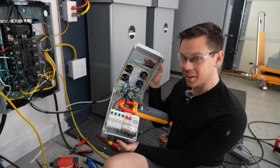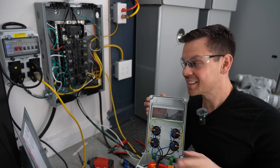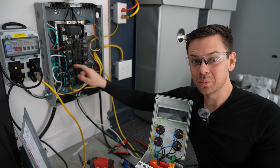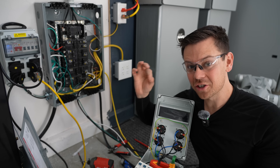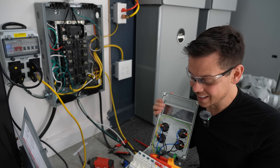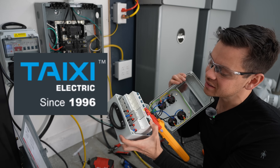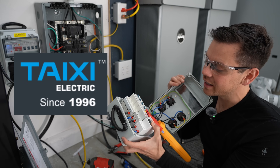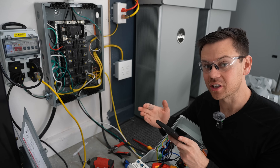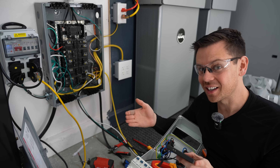These wires did pretty good — I was actually pretty impressed. I thought they would get much hotter. Now after that test, I'm removing this thing from my wall. It's not safe at all. This box is connected with an 80-amp breaker and a large conductor — having it connected to breakers that work like that is a bad idea. Just so everyone knows, the name of these breakers is TAIXI Electric. Let's see if these are UL listed. You won't believe how much garbage is UL listed — a lot of people think that if it's UL, it's good. Not all the time.